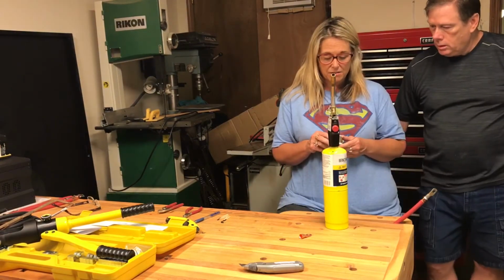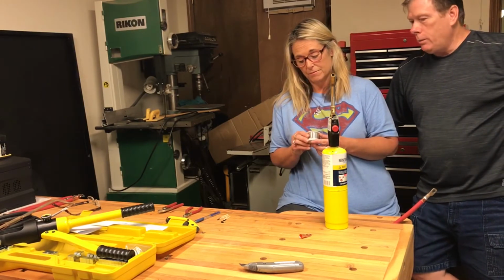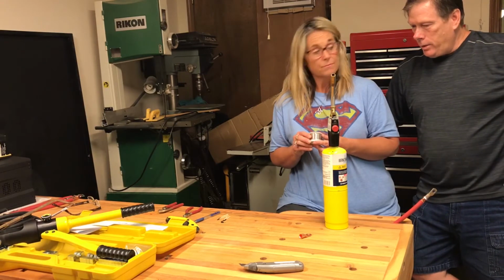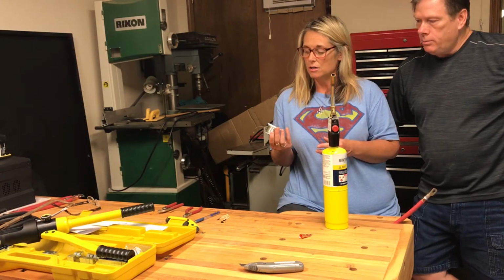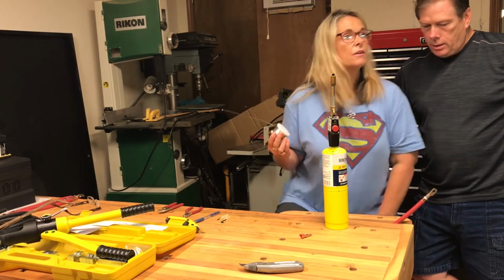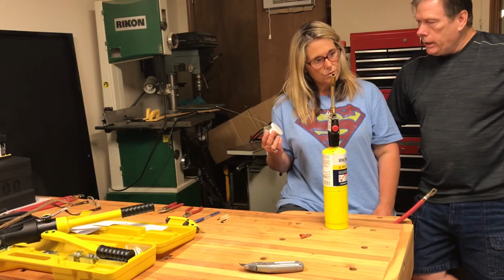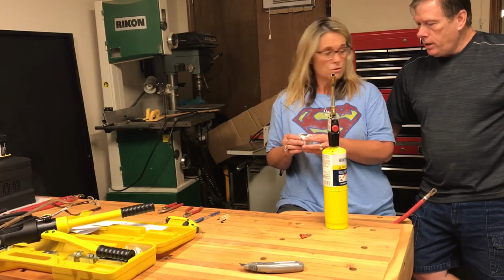What is this solder? It's like a welding material. It's a combination of lead and tin usually. This one has silver in it. And then there's also rosin, which is like a flux, like a cleaner, that's actually built into this. Otherwise you'd have to paste on a little bit of flux, which cleans things off as it burns off while it welds.